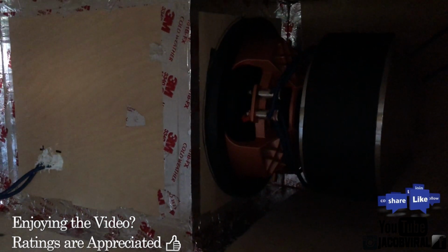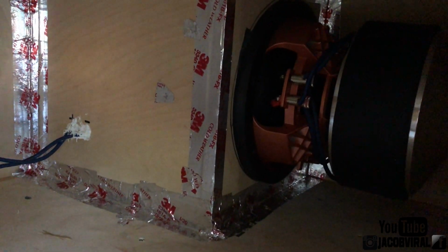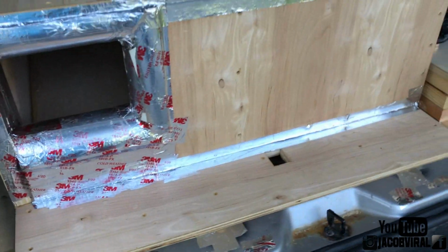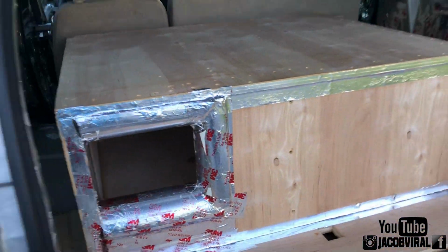So I am inverted like before, and I'm staying inverted as of now. A little more musical, not as loud inverted. I'll put some videos in the future, of course, with results of that. But so far, it's given me a little more bandwidth, musical range, as well as a little bit more lows, but not too much more, just because of the way the box is tuned with large port area. So big ratio, still really peaky, but a little more musical with it being inverted. Anyway, I'll talk about more inverted stuff later. So at this second, I'm about to find out what it meters with the port in here currently first. So I'll go from there.